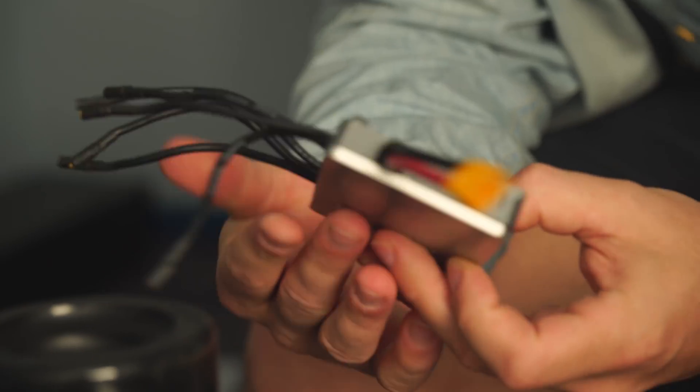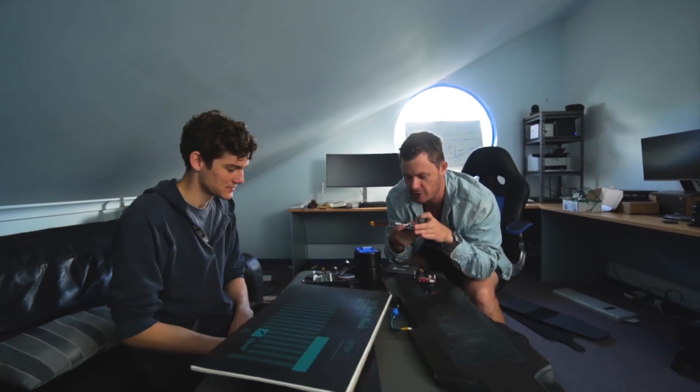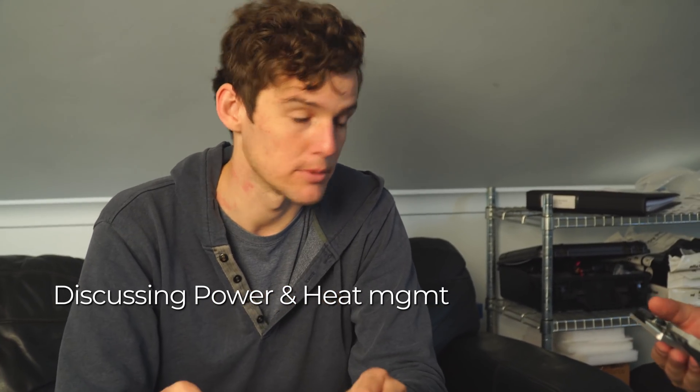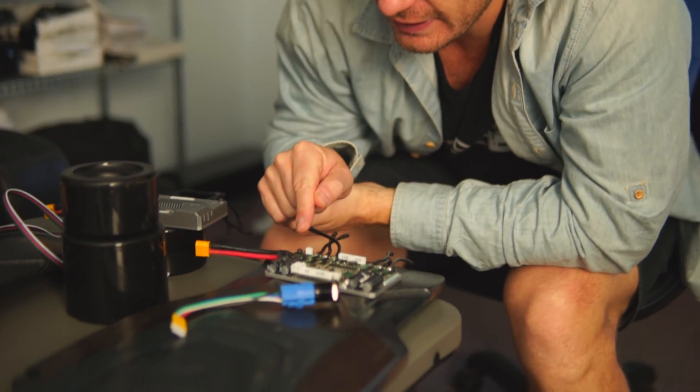They're pretty awesome looking. Scale-wise it seems a little bit smaller than what I was thinking — it's quite compact. There's a logical process of putting stuff in rows with a methodology. I still have to add in the new max motor current algorithm, which I think is going to be a home run. What's interesting about this layout is it's super flexible — a little bit of difference goes a long way for the thermals. Once it starts getting hot the resistance goes up, so if you decrease the resistance just a little bit it can make a really big difference because then it never heats up in the first place. It did take a lot more time to lay out because it's single-sided, which makes it more complicated.